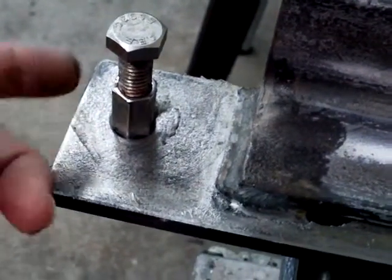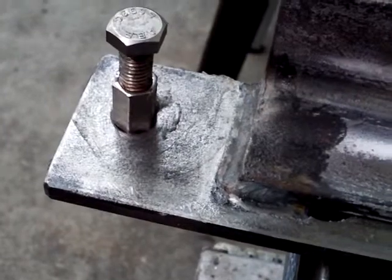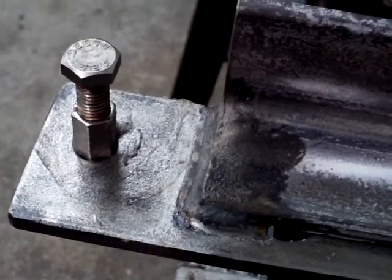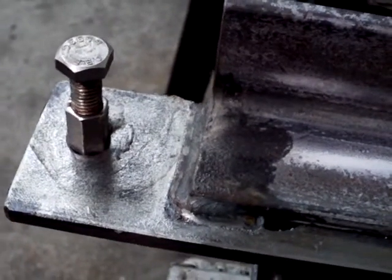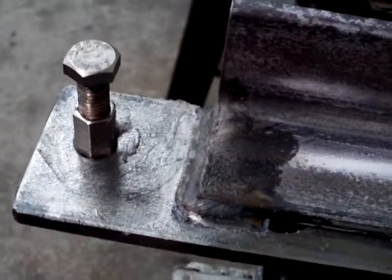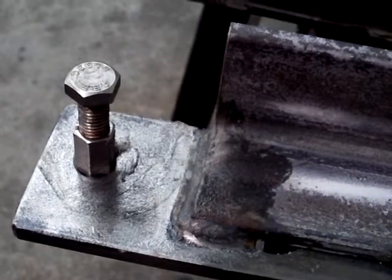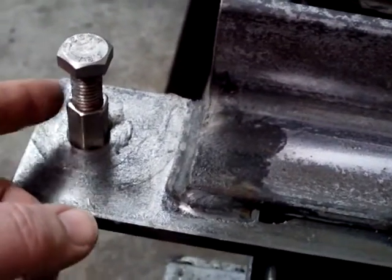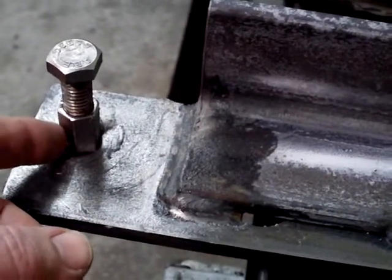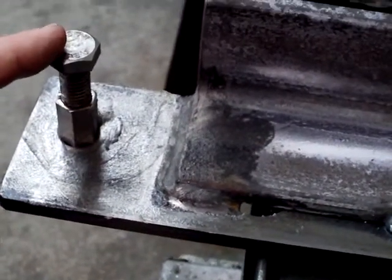It's a half-inch 13 — a standard stainless steel bolt that goes down to this nut rather than a metric bolt, so it can be replaced at any time. It can be lengthened if you have a piece of plywood on the bottom of your bed — just match up the holes and stick a little bit longer bolt in there. Even without a bolt, the nut here would allow the bed to go up and down and not jump off the kit, so the bolt doesn't have to be very tight — just snug and you're good to go.